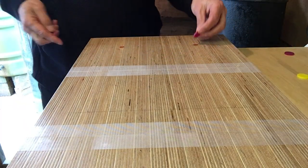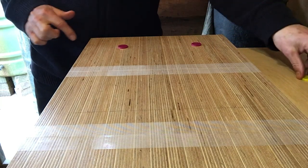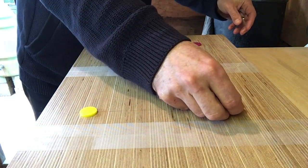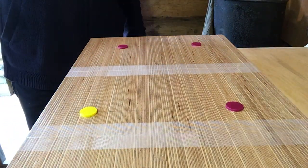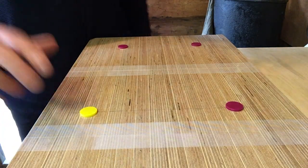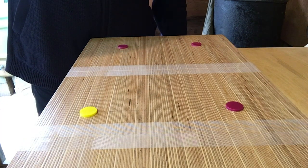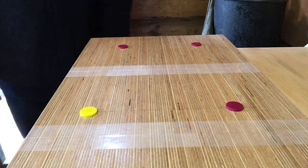Basically I've got these, which are 3.5 inches in from each corner. And then I've got 29 centimetres. I'm mixing my measurements again, but that's because I'm a child of the 70s. So it'll look something like that. And then that carries on all the way down the bench, missing out the legs there. Yeah, missed the leg. And also missing out the vise. So I'm going to leave a gap around the vise. I may put some bench dog holes near the vise at some point, but I'm not quite sure about that yet. Okay, so that's the first stage.